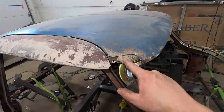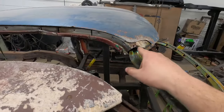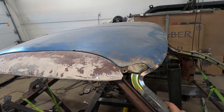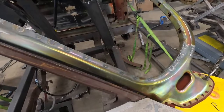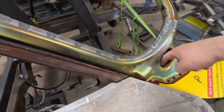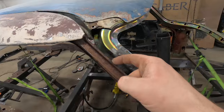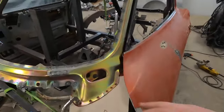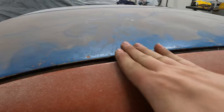Now I have the windshield frame cut out and the roof is nested in it, and overall it's fitting pretty tight. I left a little bit of slack so I can move these pieces around. I'll have to come back and make a little filler piece here on both sides. I also had to cut out the underside. My template tells me this pillar should move up forward and maybe out a little bit. I think I need to bend this flange out and manipulate the hinge pillar top to bring this thing forward because we're having a little bit of interference with the door right here.